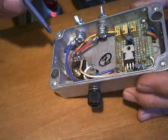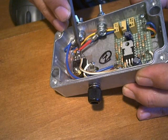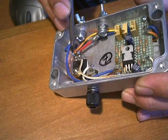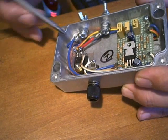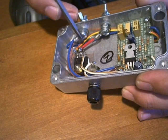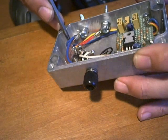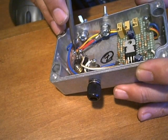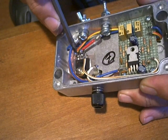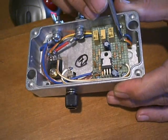Down against the case is the transient suppression diode soldered directly to the drain and source of the power MOSFET. This connects from the drain to the cell negative terminal via a piece of 14 gauge wire. My current sensing wire comes from the source of the power MOSFET — it's the yellow with red stripe wire in this particular build — and runs back to the sense plus input on the printed circuit board.